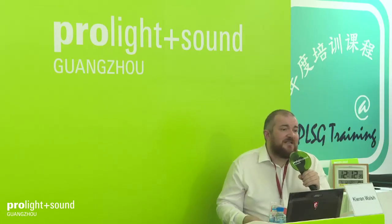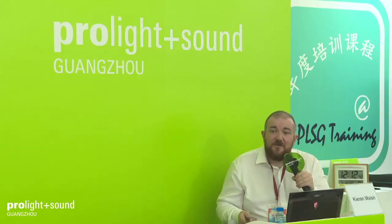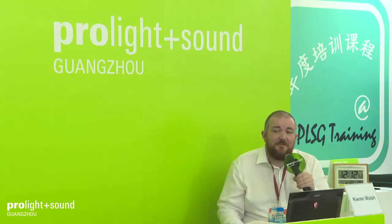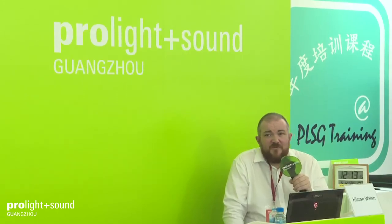So in general, you need to have an extreme pinch point in your network somewhere to see any benefit from quality of service at all. And the best way of dealing with a pinch point in the network is to build some more bandwidth into that pinch point. That becomes increasingly easy because bandwidth keeps getting cheaper and cheaper and cheaper. Two years ago, I would not even talk about 10 gigabit links. Now they're very cheap. I mean, they're coming down to a few hundred dollars. And a 10 gigabit link will carry nearly 6,000 channels of audio. It's a huge amount of capacity. I mean, really, as far as audio is concerned, the bandwidth question was really solved 10 years ago.